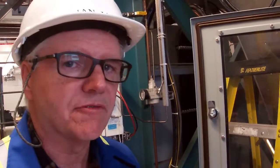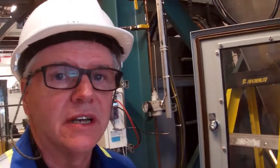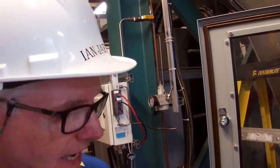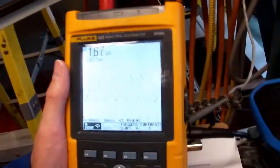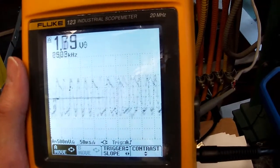So remember that we had the equivalent of 50 ohms, now we have 100 ohms, therefore we're going to be at a higher signal now because we have 20 milliamps at 100 ohms resistance in our network. And that's what we see here now. So as a check, you would be able to tell, hey, I've got a terminator that's either shorted out or maybe opened up and it's not in the network anymore. And that's why you're seeing the increase in the peak-to-peak voltage.